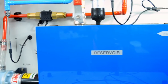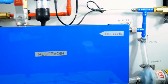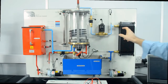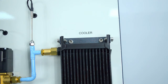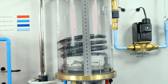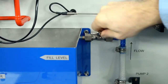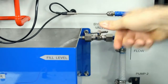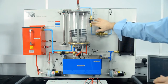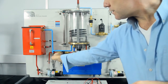The other loop is a process and cooling loop, which begins in the reservoir through the circulation pump. Fluid can be cooled through the cooling radiator and fan, flow controlled with a proportional valve, before entering the process vessel. An external disturbance can be created in the process loop through the use of the bypass valve. Both the hot and cool flow loops include flow sensors before entering the process vessel.